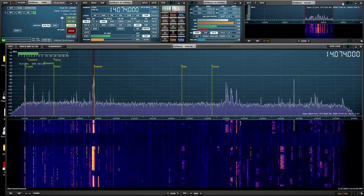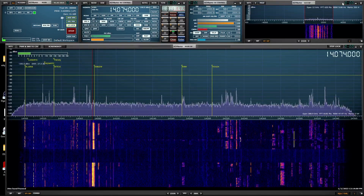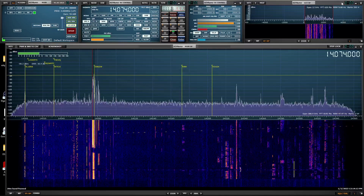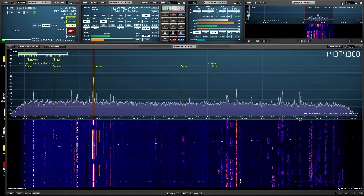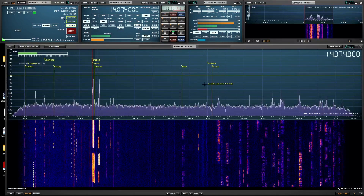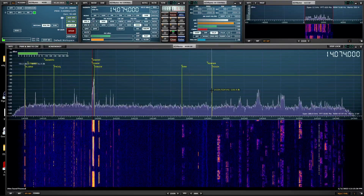That time delay is how long it takes before the device lets up, takes the circuit out of ground, and comes back to the SDR. I think this is a great solution if you're not comfortable opening up your radio and digging out the IF interface, or if you don't have an accessible IF interface. I've got this tied into a DX cluster right now so I can see spots coming up on the band and go listen to them independently of what the radio is tuned on — which is just super cool.